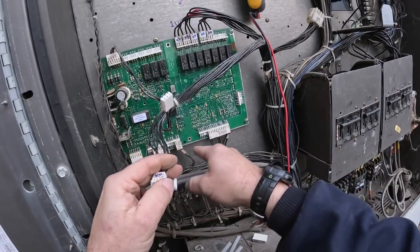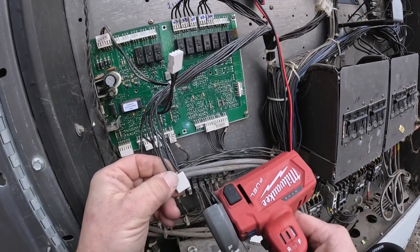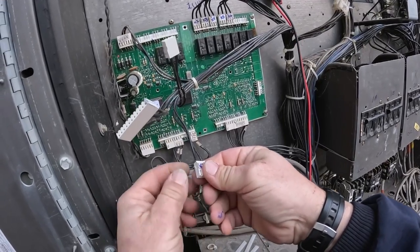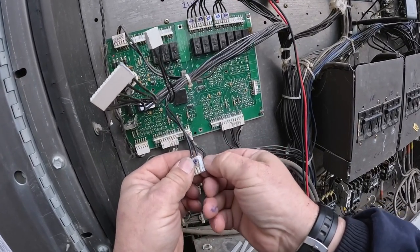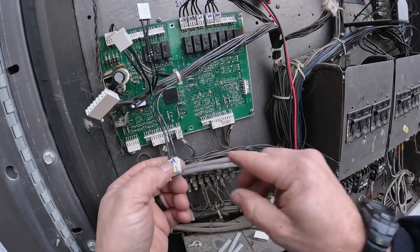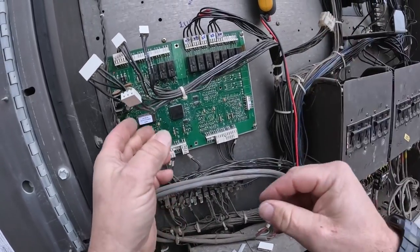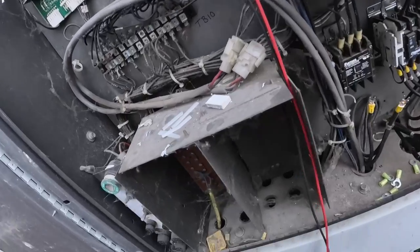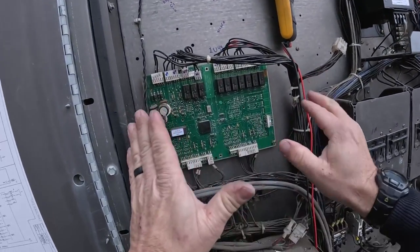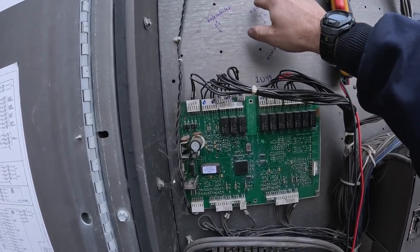Just keep in mind, I've got to switch all the pressure switches and temperature inputs and stuff like that yet. Right now, just to make sure it's working, I'm just switching the compressor circuit only to make sure it doesn't lock out. I'm going to put the circuit that supposedly locks out on circuit A and make sure it runs — and if it does, then I'm confirmed that it is the board that's bad and we can continue forward making this thing run. This has been a real learning experience. I'm not a Trane fan at all — they should have made these mirrored opposite of each other. We're going to switch K11 with K3, K12 with K4, K1 with K5, K2 with K6.